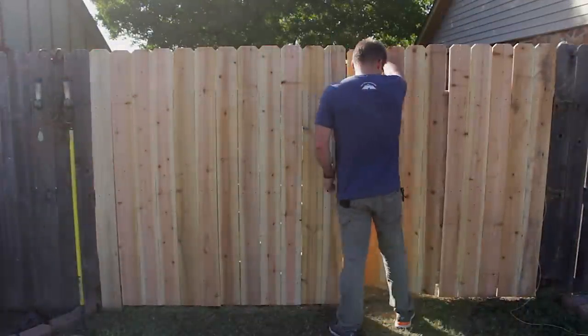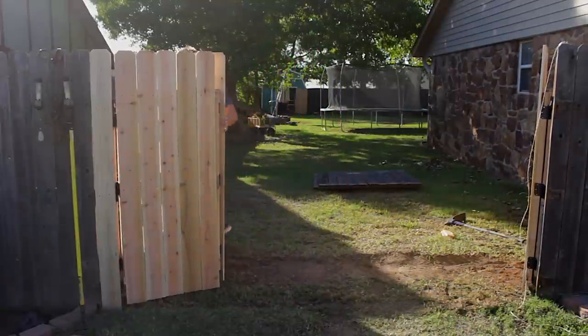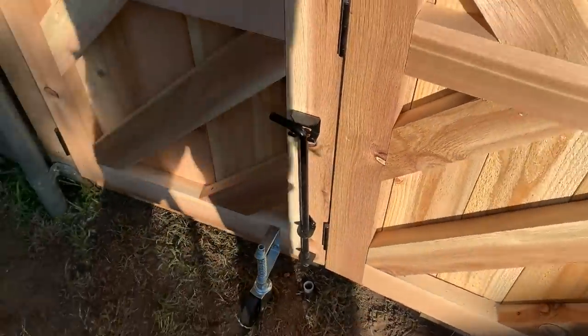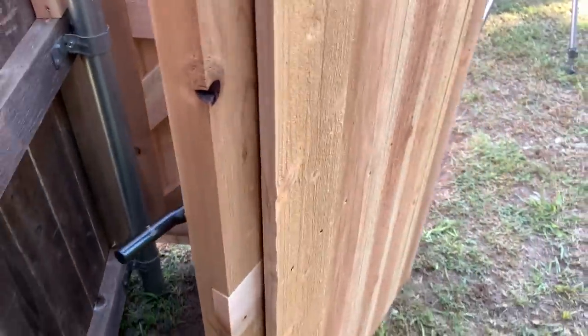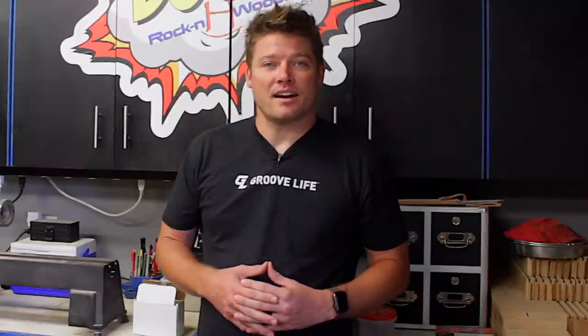A lot of the hardware I used for this fence build you can find on my Amazon store. The wheels are spring-loaded so they can go over any terrain the gate travels across. The pins are 3/8-inch diameter drop pins or gate pins that keep the gate locked in place when not in use. The hinges are also linked through my Amazon store — I'll leave links in the description for both the wheels and hinges. As for the cross members, they are all toenailed in with 2-inch PowerPro star-drive screws, number 8 head. A lot of this also has glue on it — I slathered a lot on — but the screws are there just to keep everything secure while the glue sets.